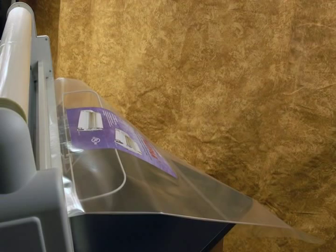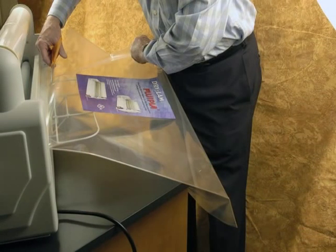Observe the laminating material exiting the laminator. If there are problems, use the motor switch or simply turn off the laminator. After the material you laminated has exited the laminator and you have no more to laminate, turn off the motor switch. Then cut the laminated material free from the unit with a pair of scissors or other appropriate instrument. Proper trimming can be done later if necessary. Turn off the power switch and return the operation lever to the open position with the black knob pointing straight up.